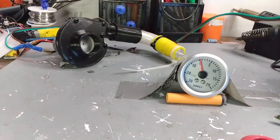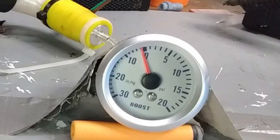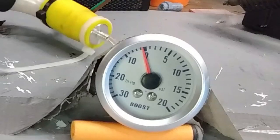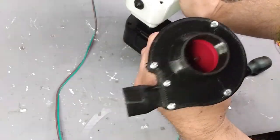The audio got corrupted for this part, but anyway — with larger screws and a better-sealed housing I do notice a slight increase in pressure overall, as well as that weird effect going away. However, the pressure is not stable, and if you compare the two impellers side by side they don't really sound the same. The load is definitely more on the second impeller, which means I'm probably running out of power on this poor little motor — or I'm just killing it.